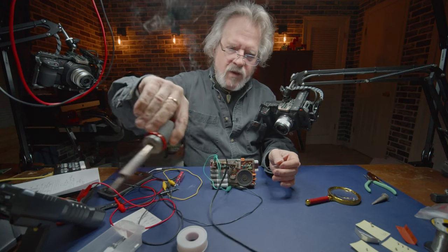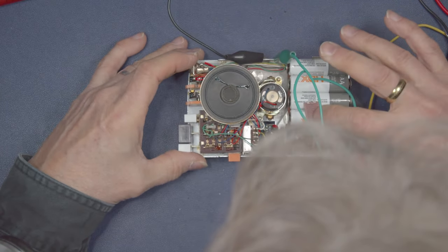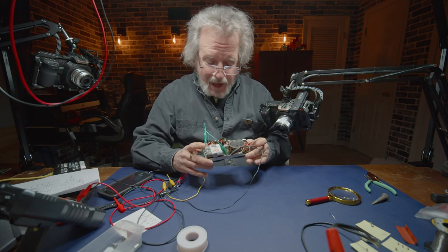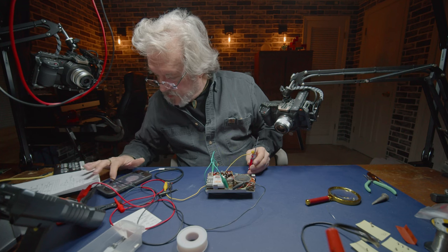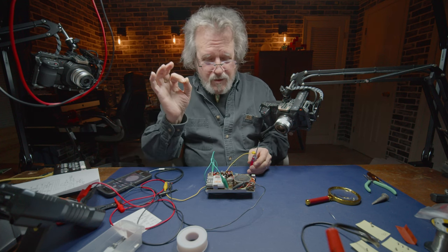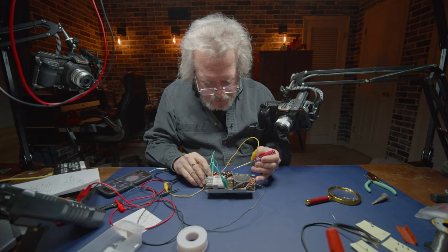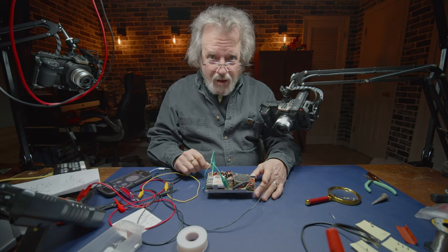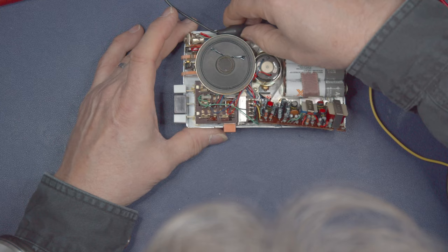I'll bet dollars to donuts if I just tack solder this - it looks like it's probably the lead for the base of the transistor of the first stage. The reels are turning, everything's working, batteries are all in place. I can hear static coming out of the speaker - I have a good feeling about this. Going back to the tone generator, reducing attenuation to negative 65 dB and injecting at the input - problem solved!